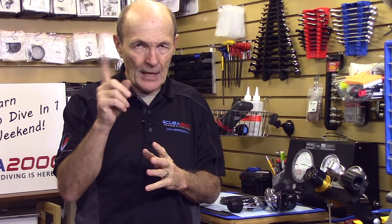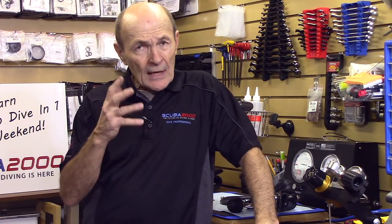Regulators are pretty rugged. But if you've been diving and you're not sure how many dives you have on it, and you're going on a dive trip — maybe you haven't used it for a very long time, pulled it out of the box — the question arises: do I need it serviced? If it's been more than two years, the answer is yes. The silicone seats, rubber seats, diaphragm, exhaust valves — everything deteriorates over time, even sealed up. You don't want to dive with a reg that hasn't been looked at in more than two years.